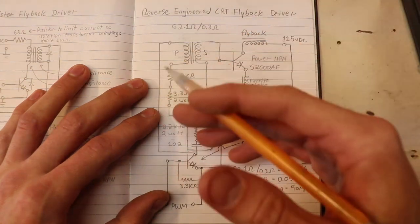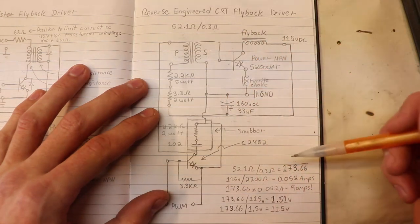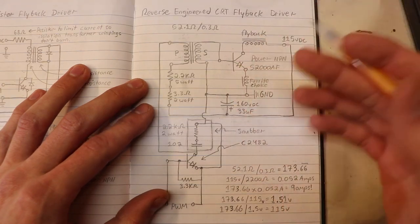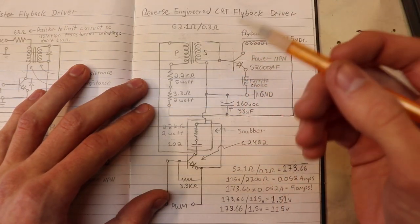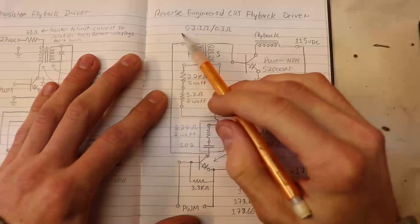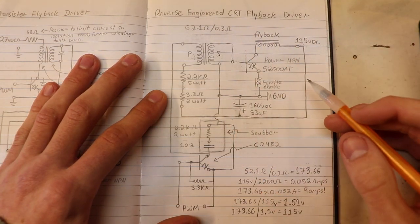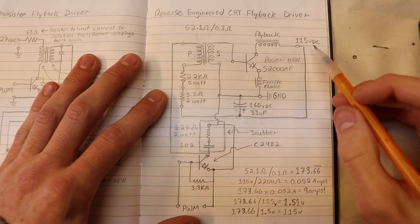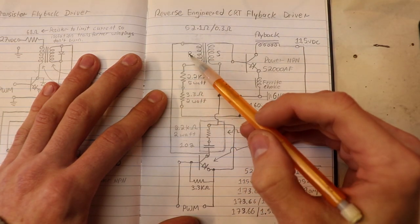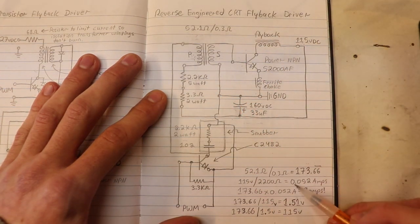So as a very rough ratio to work with in your calculations, you can just take the resistance measurements. At least that's what I do. Maybe that's not the proper way of doing it, but with all the random transformers I work with, it just saves time. Also, these values depend on how accurate your multimeter is at measuring resistances, so keep that in mind too. Anyway, once I have the known values, which is the voltage and the resistance that is going to the primary, I can figure out how many amps are at the primary, right?